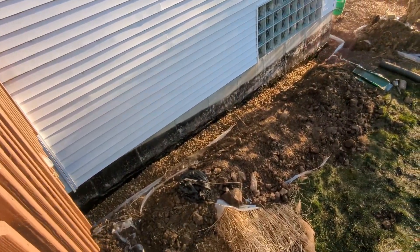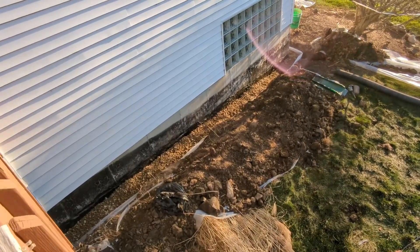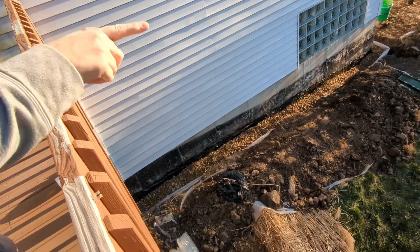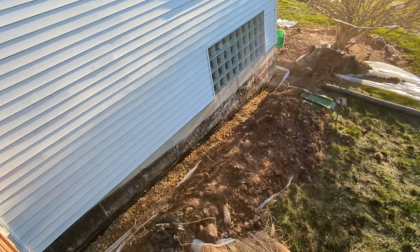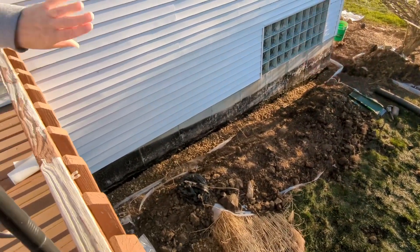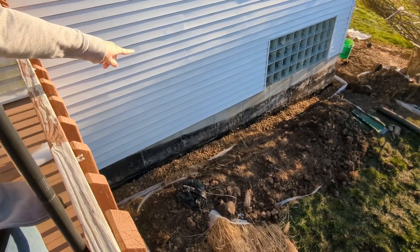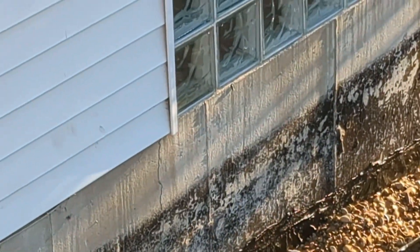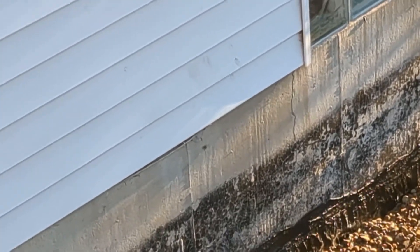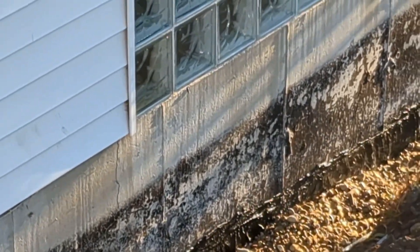Let's see what we did here. We put some gravel down there — first they put plastic, then they did that black drainage pipe, and they put gravel over it. Tomorrow they're going to put a different kind of plastic on top, then backfill it with all the dirt. And they filled in the crack — oh, they also put that really thick tar down in there. They put that thick tar in the crack — it's completely filled in and that was the only crack they found.